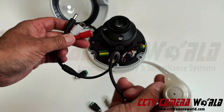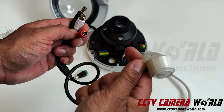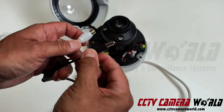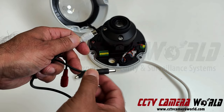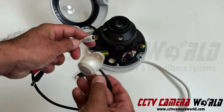First, you have to provide power to the mic using the 12-volt jack. The microphone itself needs power, so that comes from a separate 12-volt power supply. Make sure you have that connected. This connector here is a power relay — if you wanted to connect another device to this, this particular mic offers that, though not all mics do. And here is the audio out from this mic.